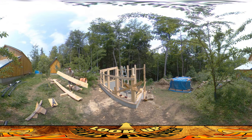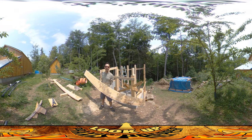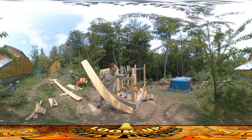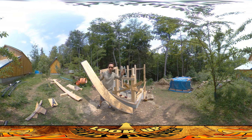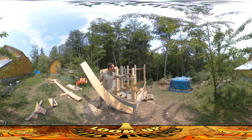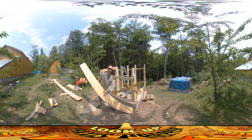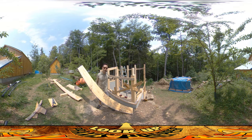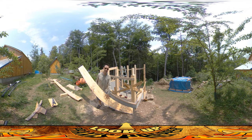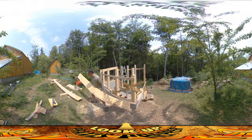This is the first rafter, which is still kind of wet so it's heavy. This is the first rafter that went up and I'm using it as the template. I made this one first by putting a board up into this section that was oversized, too long. Got it all nice and in there, made marks on either side, brought it down, cut it into this — and now I'm using this to build all the other boards. This will be the last one that goes up, so the first one I made is the last one that goes up because it's the template for all the other boards so they're all exactly the same.